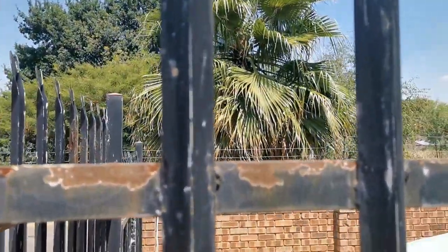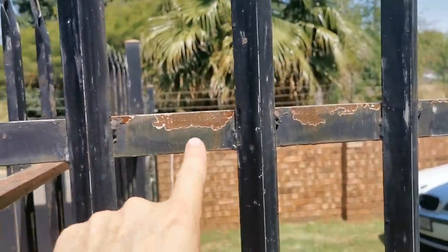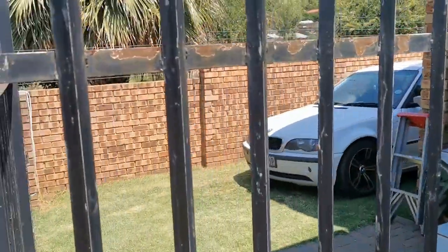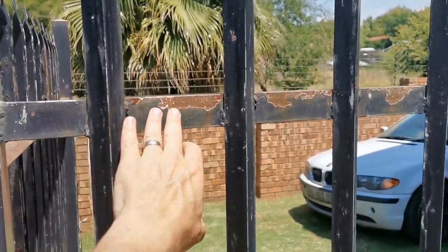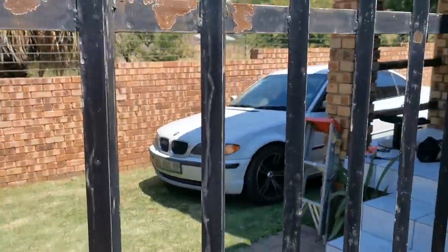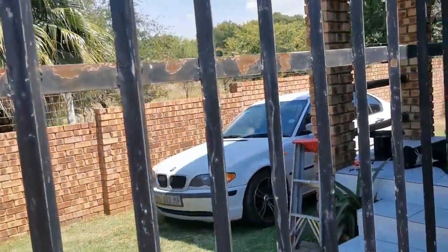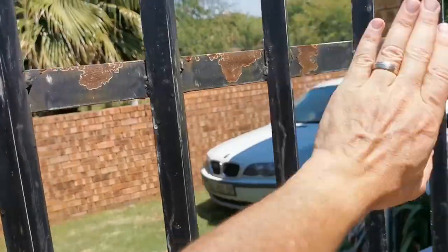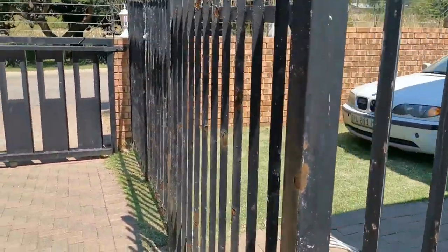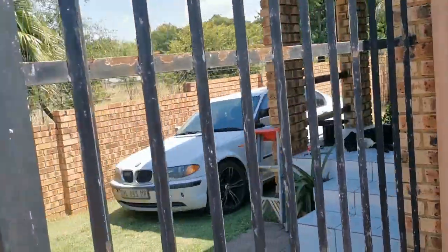It's already 12 o'clock in the afternoon. Coming back to the palisades - this panel is now completely done, inside, outside, top, bottom. Everywhere I grinded all the extra loose paint and some of the rust off. So what I'm going to do now is complete the rest of this piece of fence, then take some sandpaper and quickly go over the rust spots one more time, and then add the red oxide, or rust inhibitor, and that'll be our task for today.